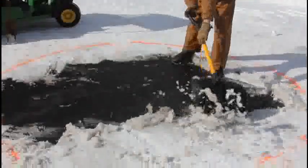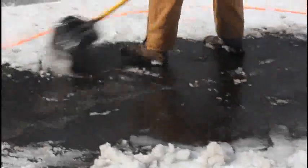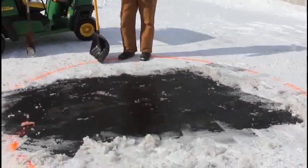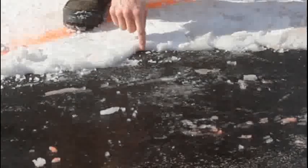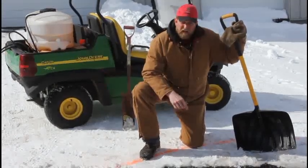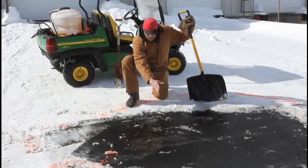Versus this area — realistically, this is what you can expect from the stand-up. This is what it will do for you on your sidewalks, your steps, your ramps. You can see we're right at maybe three quarters of an inch, and that's about the melting limit you should expect when using stand-up. Anything over three quarters of an inch is really asking a lot. But remember, stand-up's best friend is time. If you apply the stand-up and let it set and do its thing, these are the results you can expect.